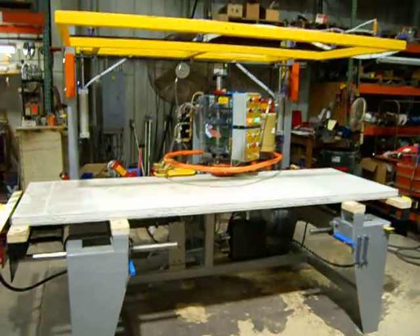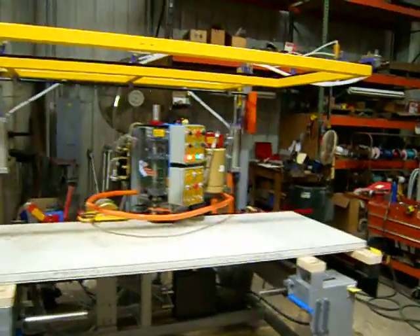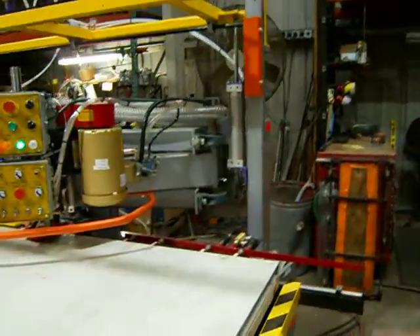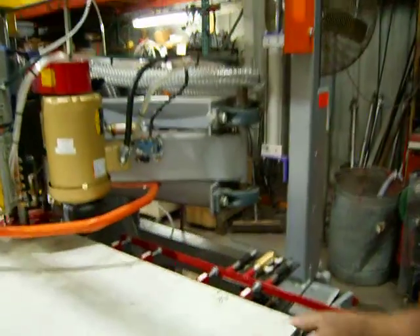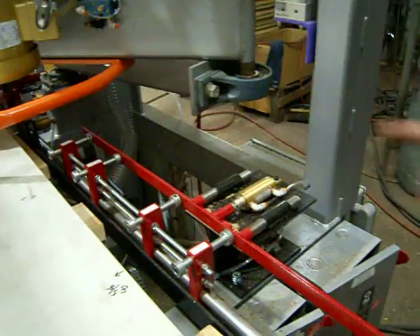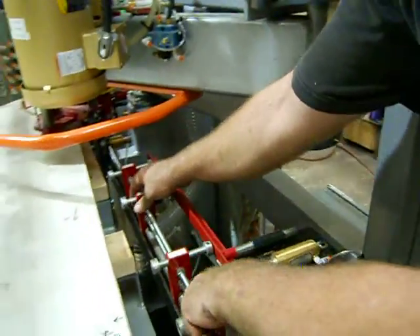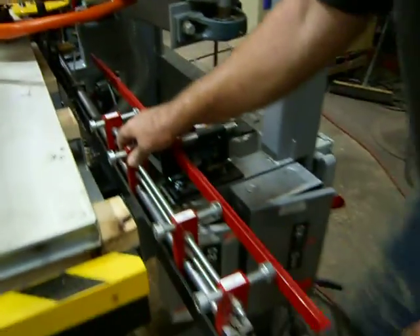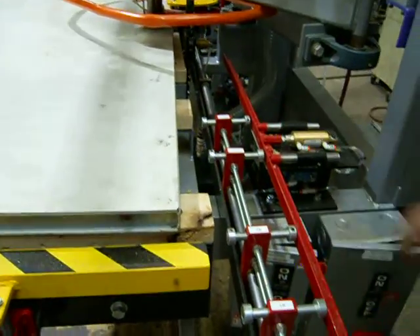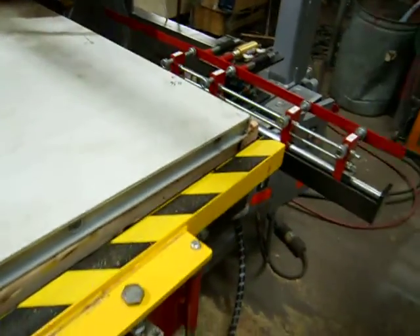When we went over earlier how to set up your lock bore locations for your six-eighth and deadbolt locations — we won't go into a lot of detail because it's all in the previous video. The one thing you must know when you do an eight-foot: there's a ratchet handle right here. You loosen that up, take all of your stops, slide them up against this solid stop here, lock that back down. Now it's set up to do eight-foot. Obviously back in the other position is your six-eighths.